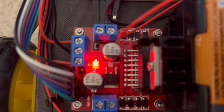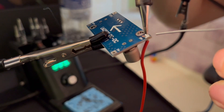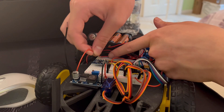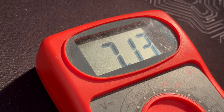It seems that the voltage regulator on the motor controller cannot take power from the battery and simultaneously power our servos and electronics. I took care of this by splitting the power with a buck converter, which essentially turns a higher voltage into a lower voltage and then takes the extra voltage to provide current, giving stable power. The buck converter powers the servos — mainly because the servos take a lot more current — while the electronics would only be powered with the voltage regulator. With the new buck converter, the voltage regulator on the motor controller would only need to supply low-power electronics, which is perfect.